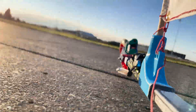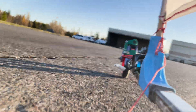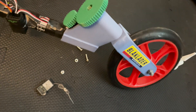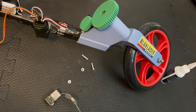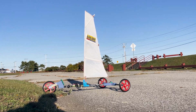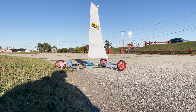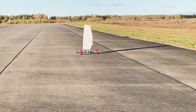The one thing that I kept saying to myself every time I used the cart up in Maine was that the steering was so poorly designed. I had made a pushrod system, transferring the torque from the servo linearly to a control surface on the steering axis. Why didn't I just use gears to begin with? It offers a constant mechanical advantage over the system and allows for an overall greater mechanical advantage as well. When I got home, this was the first thing that I changed — I modeled some gears and replaced the old steering system, and I could tell it already worked a lot better. I was seriously running out of time, so I went to a local empty parking lot on what should have been a breezy night to test out the new steering configuration. Unfortunately, there was absolutely no breeze at all, but I was really happy with how well the thing worked for the little time that I had to throw it together.